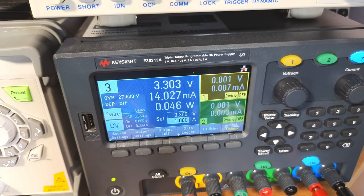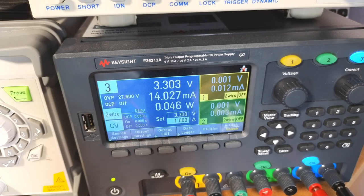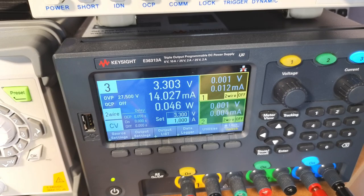This won't revert the unit, as you know. This is just showing you how to set a board up to read the Syscon. Primarily the FAT board, which is the easiest one to work with. What I shall do is another video showing you how to read the NOR, and a little bit of that patching on another one.